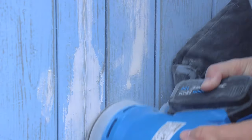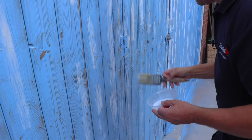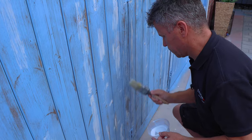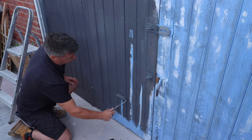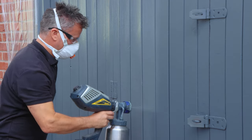Although Quick Fill is predominantly used indoors, if using it for outdoors, make sure it's dry and sealed with a weatherproof sealant before it's painted. Once this is dry, I start to do my painting. In their video you'll see me apply the paint in three different methods: a paintbrush, a roller, and then the paint sprayer.